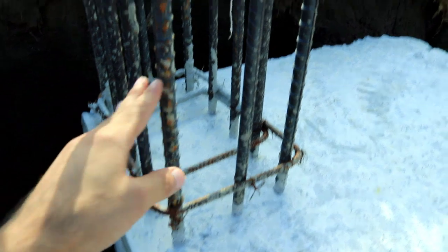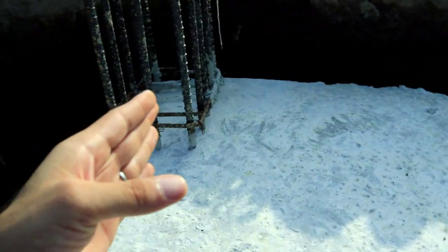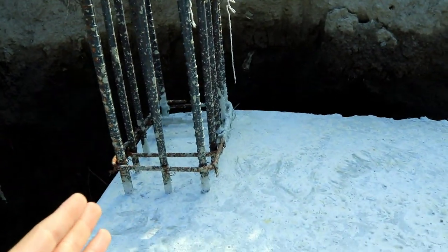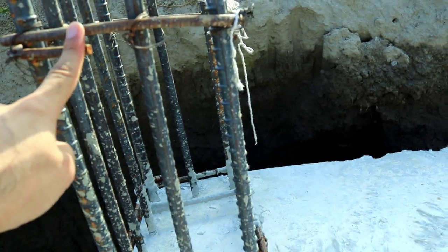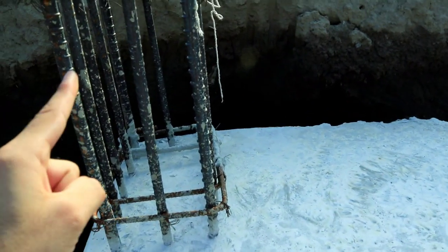You can see 12 numbers of steel bars, and the alignment appears wrong. But this is because this is a boundary column — it should be at the center, but it is not at the center because it is a boundary column. You can see lateral ties which diameter is 8 millimeter with a spacing of 15 centimeters, or six inches.